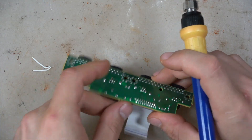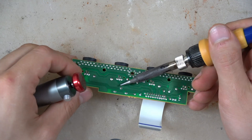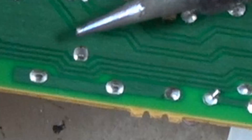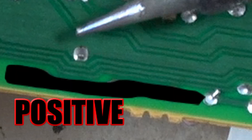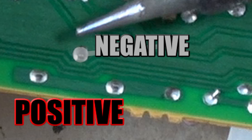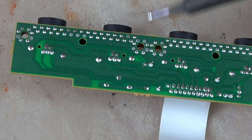The battery connector is connected through three prongs, but I'm actually going to be using a two-prong because I don't have a three-prong one — I only carry the two. The first two solder points are positive. So if you have a three or a two, you just need to connect it to positive and negative. By knowing that, you'll be able to figure it out based upon whatever battery you have.